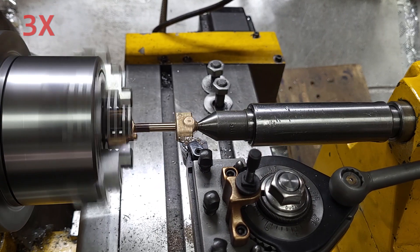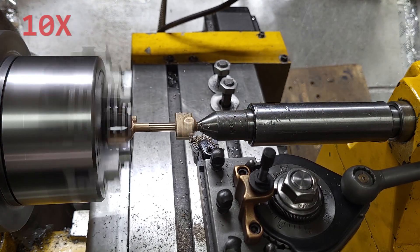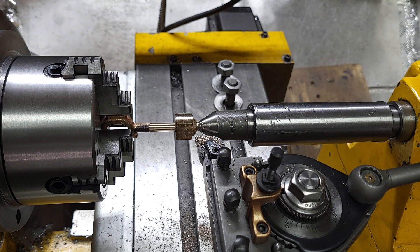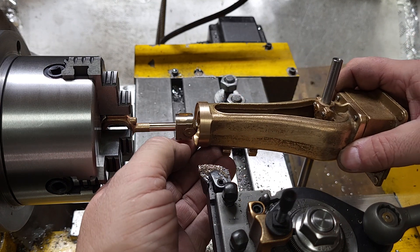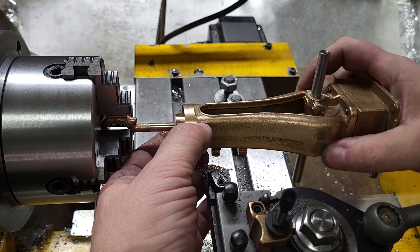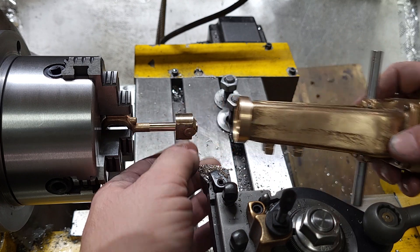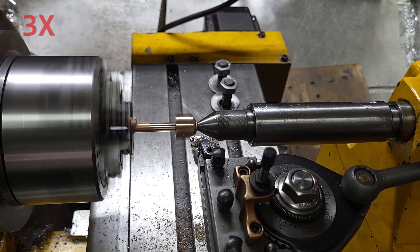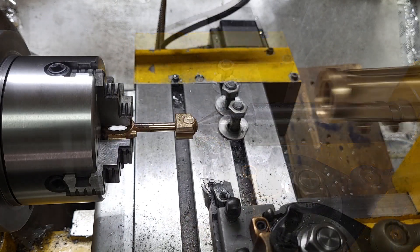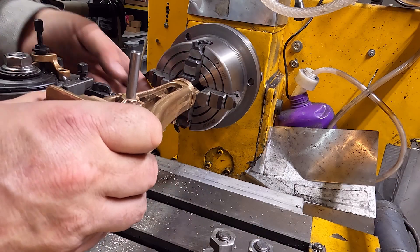...until the very last pass, where it didn't. I had it down to about 0.7495 and it was almost going in — sort of kind of tight. In retrospect I should have just used a little bit of emery paper to bring it down, but I thought I'd do another spring pass. That was the wrong thing to do, because in that pass you can't see it doing much but it's taking more metal off than it's supposed to, and now it's too loose — 0.746.